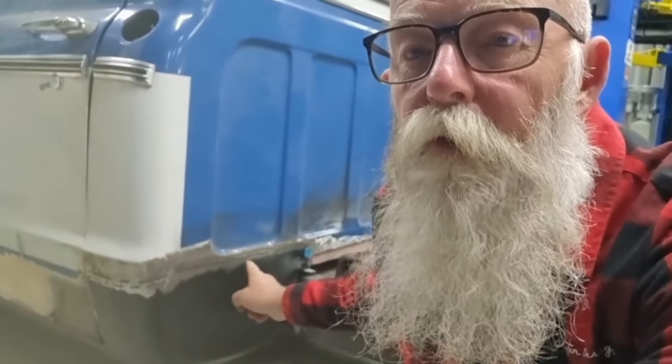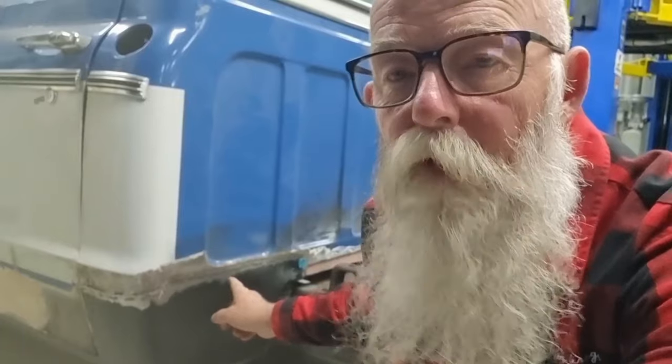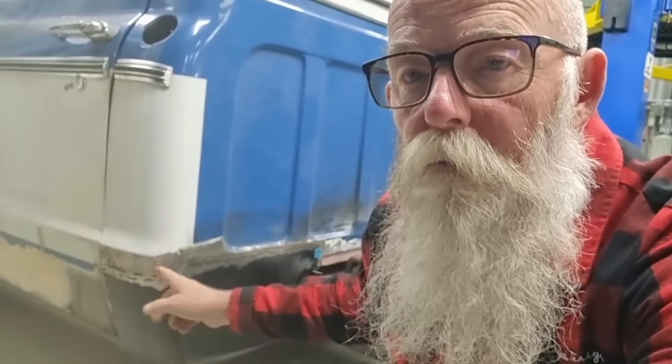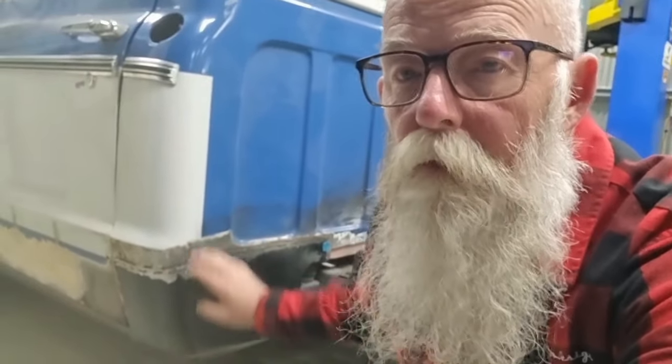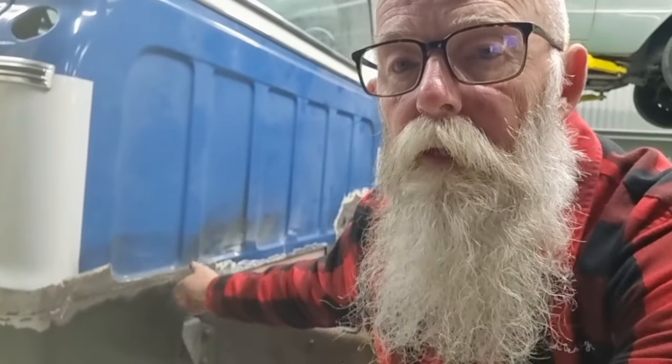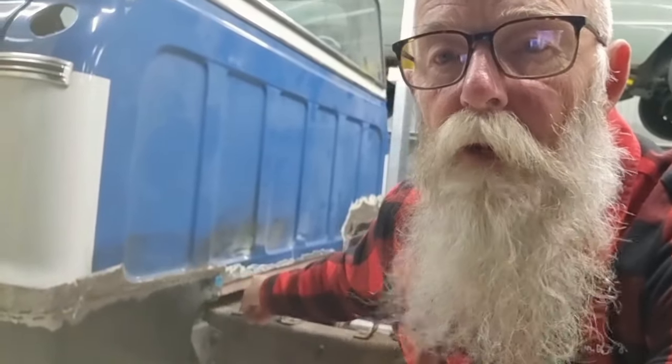So I haven't finished grinding this off yet, but what I'll do, I'll go through there and we'll use a fine flap disc and we'll probably get the die grinder with some even finer grit on there as well. And we'll get that to a paint ready stage, well, primer ready stage. So it's all looking pretty good. I'm very happy with it, the way it's come up. And as we said, we'll finish this part here off as well. It's all looking pretty good on the inside.